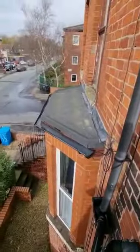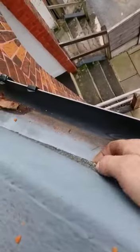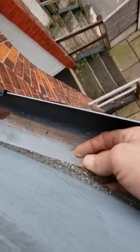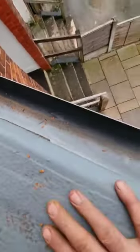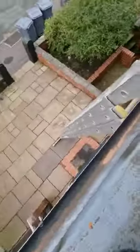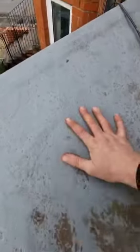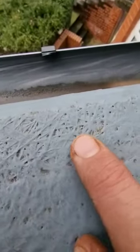The flat roof itself was green mineral, like next door, and you can see the evidence of this underneath. It seems they haven't used any board — they've just gone straight onto the green mineral. It looks like a reasonable system, to be fair; they've just not done it correctly.